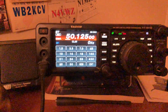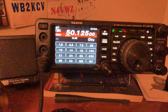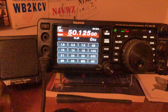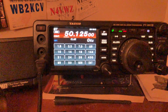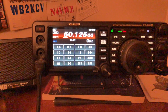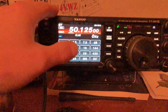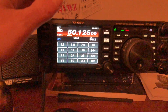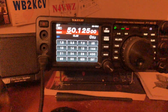The only thing this radio doesn't have band-wise is the 1.25 meter band — the 220, 222 MHz band. Most modern all-in-one radios will not have the 220 band, only because I believe it's just the United States and one other country in the world that has those privileges, so radio makers don't think it's marketable. But once you upgrade to General or Amateur Extra — or if you're an older advanced class — this radio covers 160 meters all the way up to 70 centimeters, minus the 1.25 meter band.